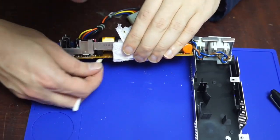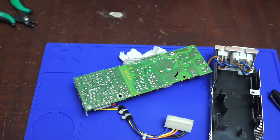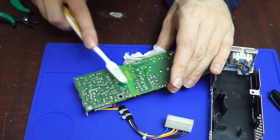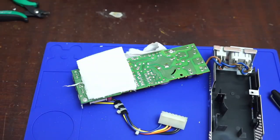I realized there was some electrolyte on the side of the PCB that also needed to be cleaned up. I then cleaned the bottom of the PCB with plenty of alcohol and a toothbrush to loosen up any flux or remaining electrolyte, then blotted away with paper towels.